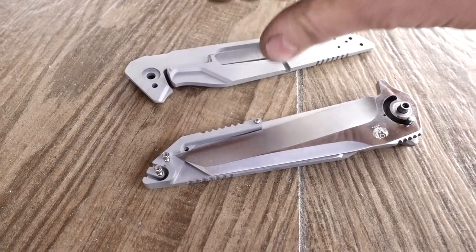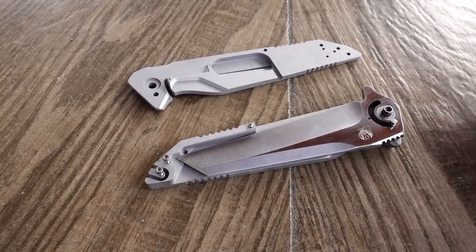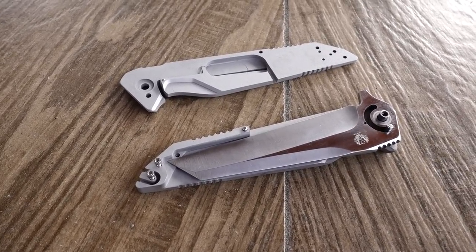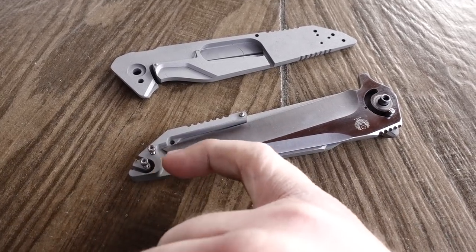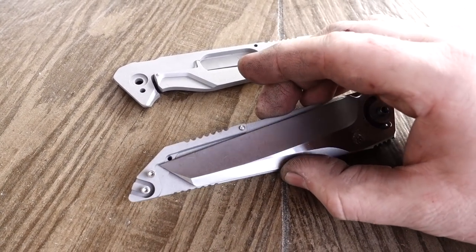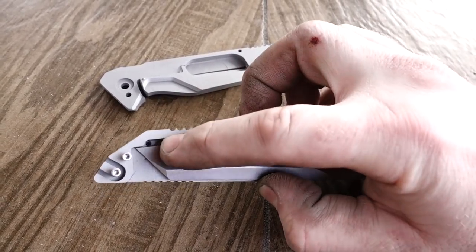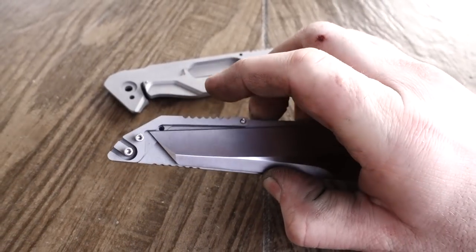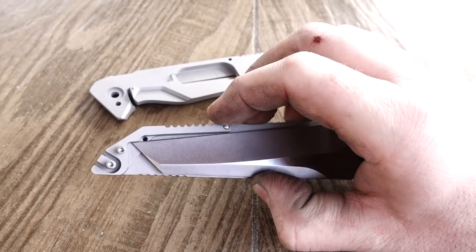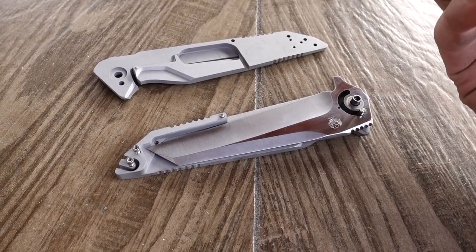I want these to be able to accept whatever kind of blade shape the user desires, so I leave the mounting areas there for whatever blade shape we want to put on there. If down the pipeline you decide you hate the wharncliffe blade and want to put a tanto or a drop point on it — that blade swoops up a little bit and the geometry is different in the back end, so it doesn't have this issue. You can put three screws in the back on those blade shapes. But on the wharncliffe version, if you close it especially quickly, you can actually contact that back screw. There's a cutout in the back spacer to allow clearance for the wharncliffe, and it's usually not an issue if you keep that third screw out. If you put that third screw in, you can get tip damage — which is incidentally one of the reasons why that particular knife had been damaged in the first place.